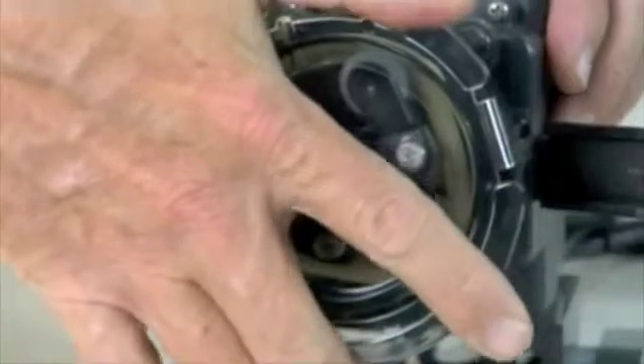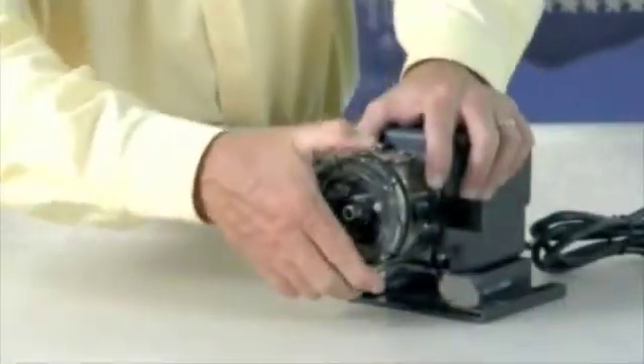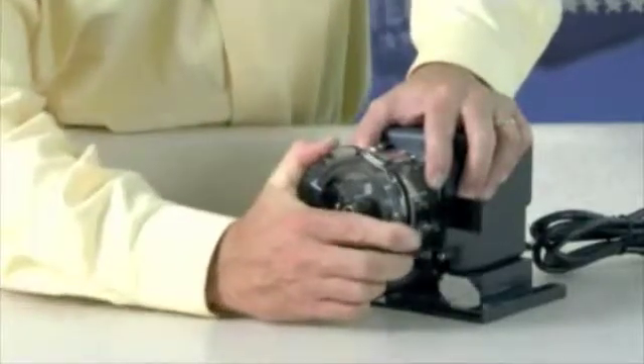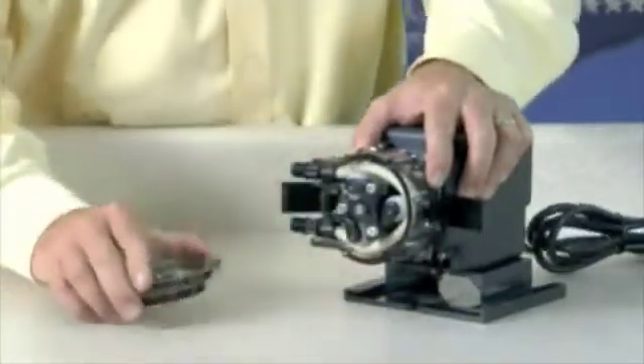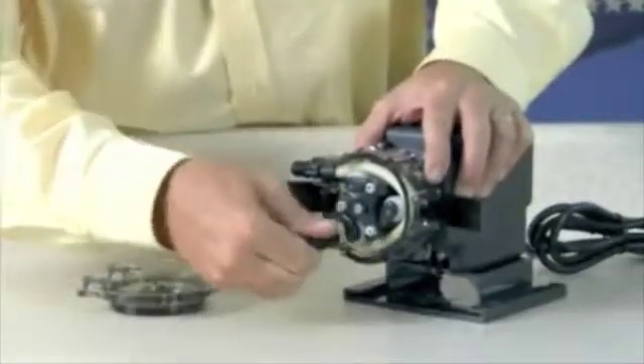Position the cover feet near the tube fittings. Hold the pump securely. Use the tube housing cover as a wrench and quickly snap — rotate the cover counter-clockwise to collapse the roller assembly. The tube will no longer be pressed against the tube housing wall. Remove and discard the pump tube.